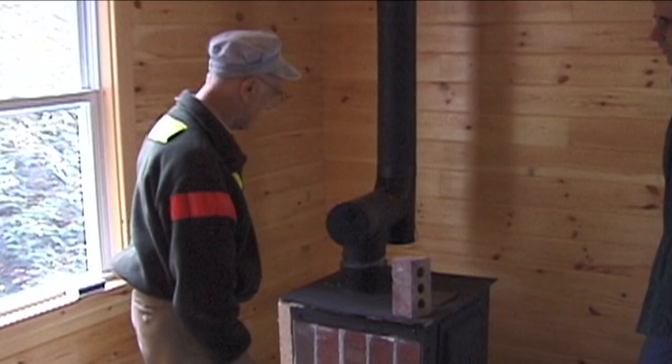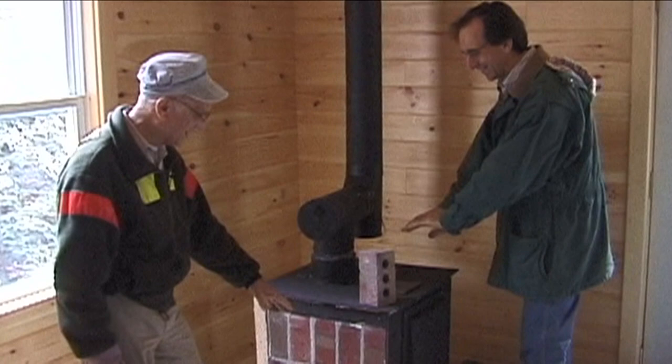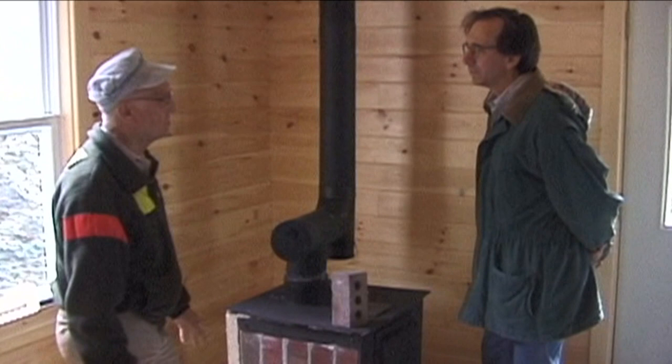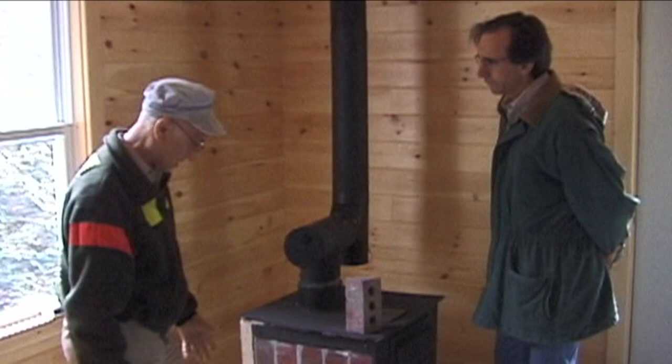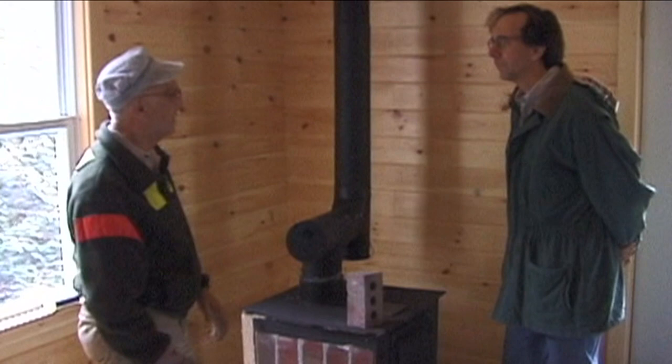Now, this is a masonry stove. Inside of these bricks, I built a hardware cloth cage, and I just supported it in a very clumsy, awkward way. But I used that as a form to pour refractory. So the cast refractory is a big arch inside that goes down the inside of the bricks. And as I assumed would happen, the hardware cloth is all melted out and burned out and gone away. But the refractory is obviously still intact.